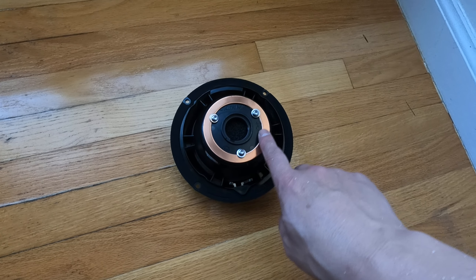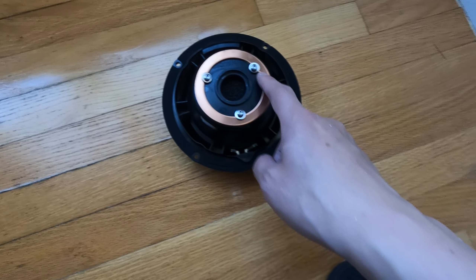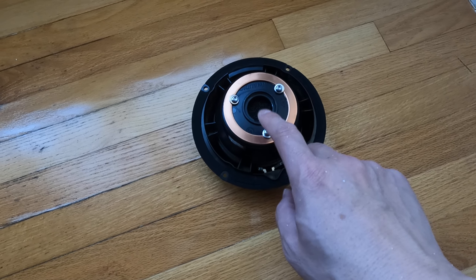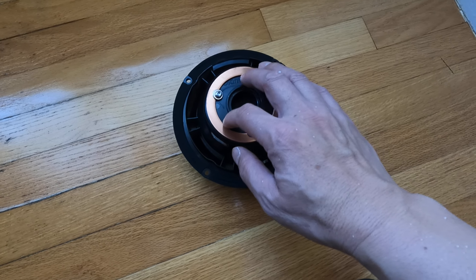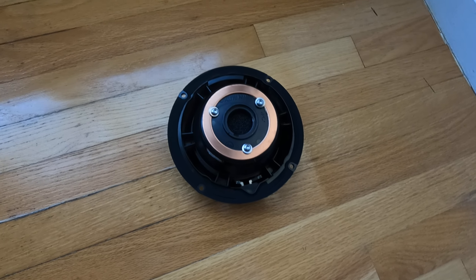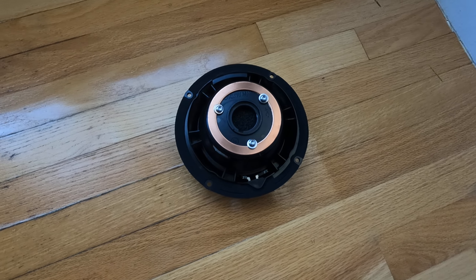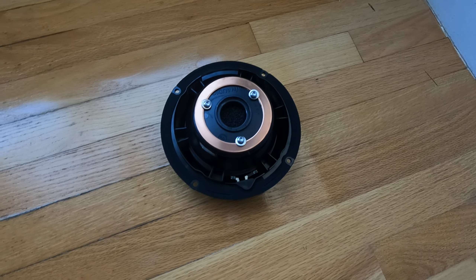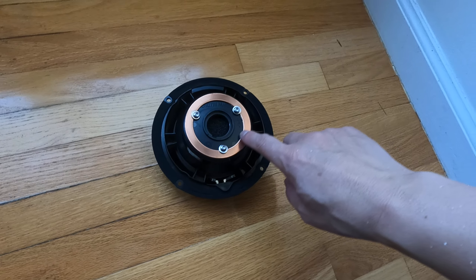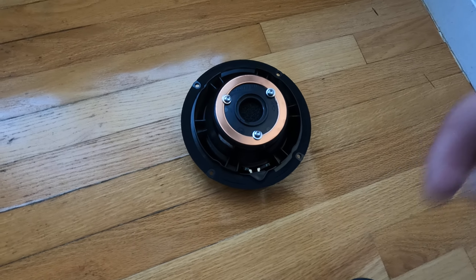The way I reinforce them — we shouldn't say repair because they're not really damaged — is I use a copper ring and put glue at the interface between the ring and the plastic, then use a slightly longer screw to hold the copper ring down against the plastic housing. This makes sure everything is very strongly reinforced and we won't have any problem after we put it on. It's very high quality, and the copper ring will also help to short some of the electromagnetic leakage as well. Good stuff you can do.